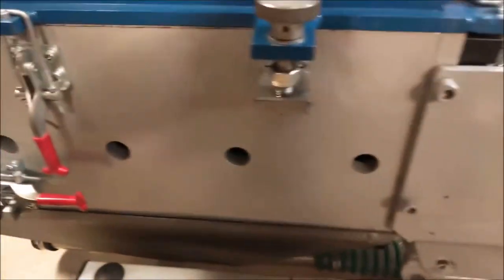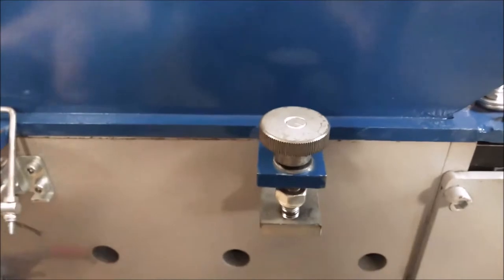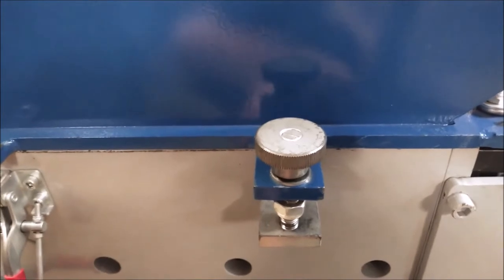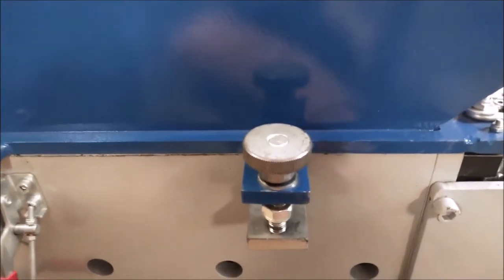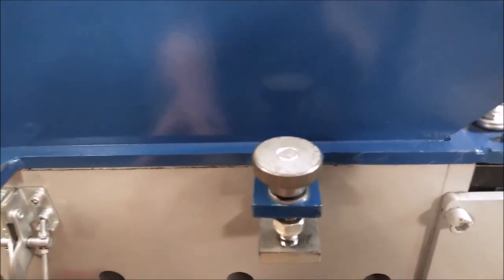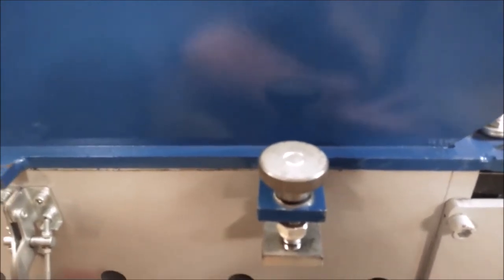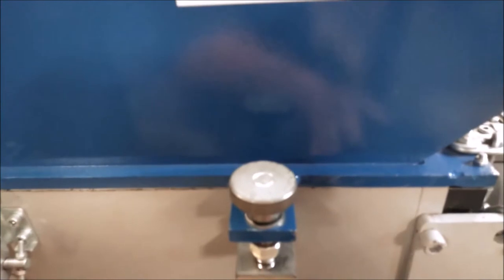This is what they call a grinder — it's more or less like a wood chipper but for plastic. Plastic runners are the leftover parts after you injection mold your part; you have these leftover pieces and they become scrap plastic. Depending on what kind of parts you're running and what grade of plastic you're using, you can actually grind up the plastic and reuse it in the next shot going through the injection molding machine to make parts, or you can grind it up and ship it out to be reconstituted and resold. If you grind up runners, you could turn six boxes of full-size runners into one box.